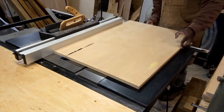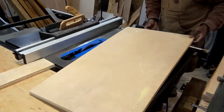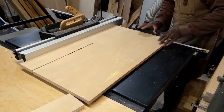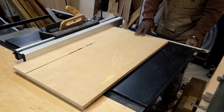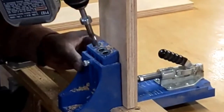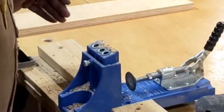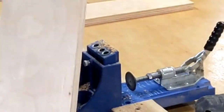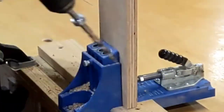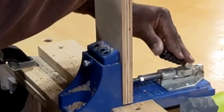We started out this build with 3/4 inch Baltic birch plywood. I've already cut the sides and the bottom for the box. These are going to be the two support pieces on the top of the box. I'm ripping these out of some leftover birch I had in the shop. Next I'll drill the pocket holes for those support pieces to connect the box — I'll put two holes on each end, which should be sufficient to hold things together.